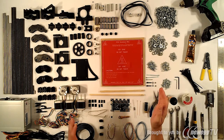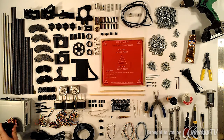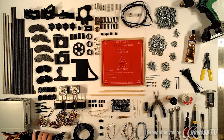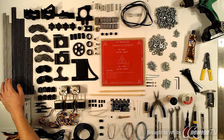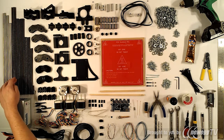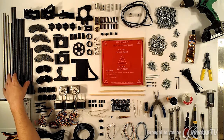Now I'm going to go over all of the parts included in a complete kit. This includes a 480 watt ATX power supply with a power switch connected via a copper wire and a 6 foot power cord. The kit comes with flush fit, cut, smooth and threaded rods. The length of these is different from what's specified at reprap.org because these are flush fit — the spec lengths leave overhang, so these make for a really nice looking RepRap.